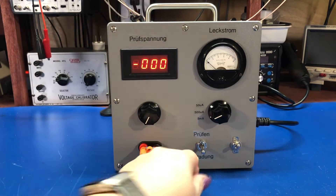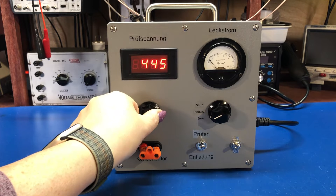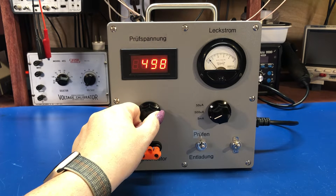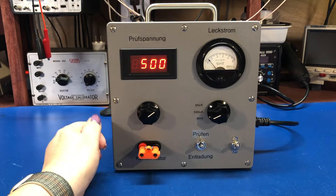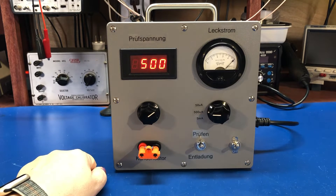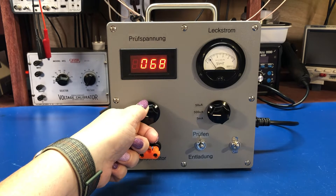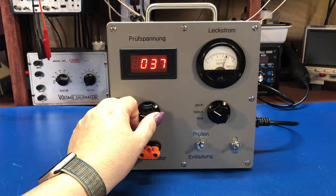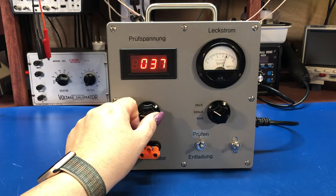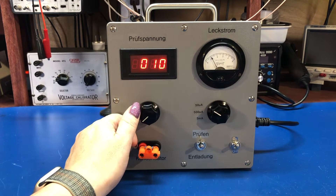Just to show: if we take the resistor here on the 5 milliamp scale and bring it up to 500 volts, you can see we just get 0.5 milliamps or 500 microamps of current. We bring it down, and if we jump up to the next scale, we can see we've got 37 volts going in and about 37 microamps worth of leakage. At 10 volts, 10 microamps.